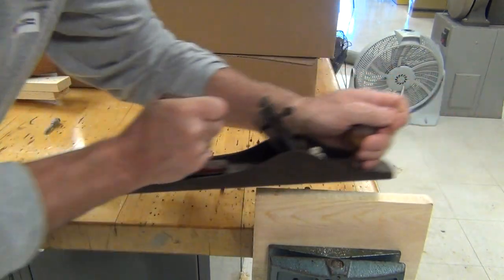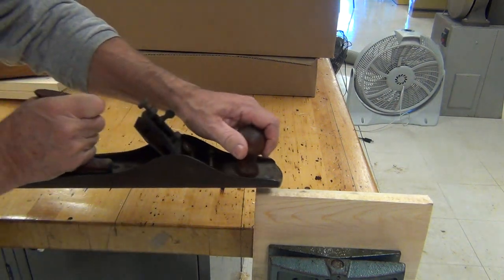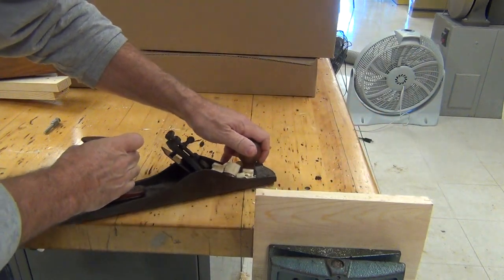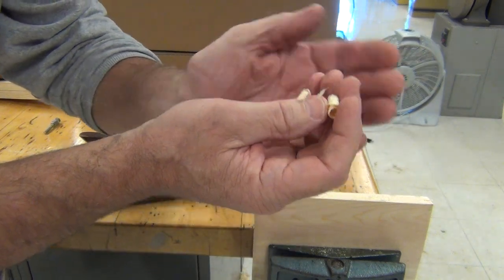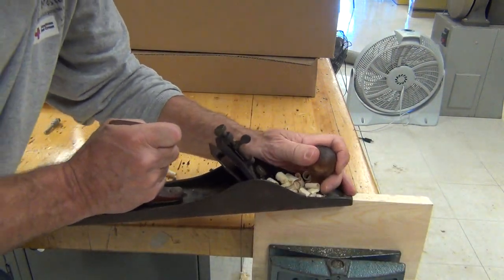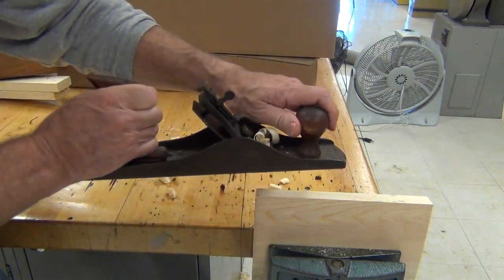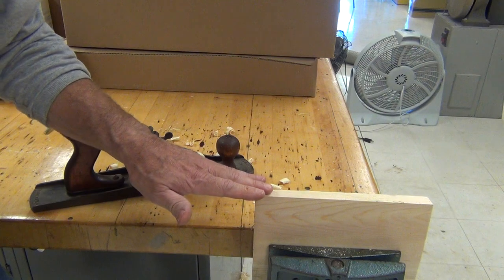Because the surface is so rough, it's not cutting in all places at once, and that's okay — it's taking off the high spots first. It shaves off these long thin strips of wood, these curly cues, and that shows you how it's taking away the wood. We end up with a pretty smooth surface compared to what it looked like before. Because the bottom of the plane is flat, it rides across the top of any bumps and takes the tops away first, eventually coming down even to a totally flat and smooth surface.